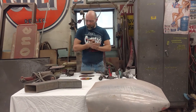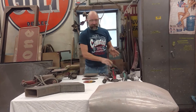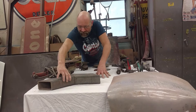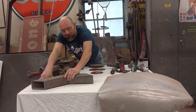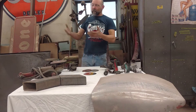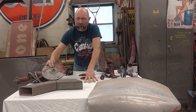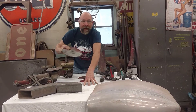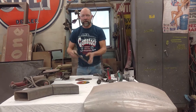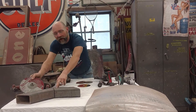Here at our shop we love tools, and we have similar grinders set up with different tools. A lot of times when we're setting up a joint, we'll leave a small gap, weld it up, but then we've got to grind it off. What a lot of people do is take the grinder like a soap sponge and run it back and forth. Guess what that does? It makes a mess, especially running the grinding wheel back and forth this way — it creates a hollow on either side.